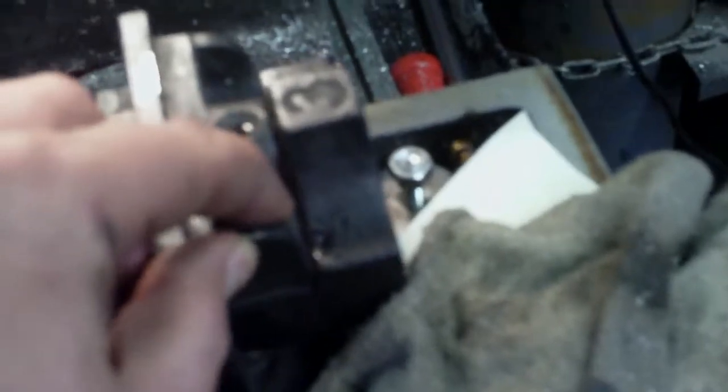And what I'm going to do now is put this jaw back in and surface the top of it. But I have to figure out what I'm going to do with this jaw, because it's the moving jaw, it's got some looseness in it, and obviously decking this increases that motion. And granted, if it becomes a problem, I might have to put some shims under this, because I took probably about 20 thou off this, maybe 25. But I'll wait and see.